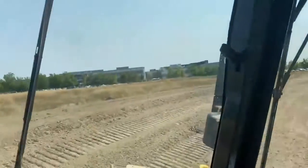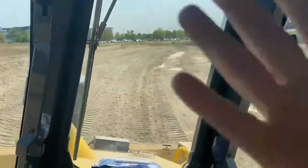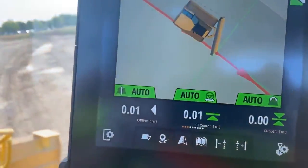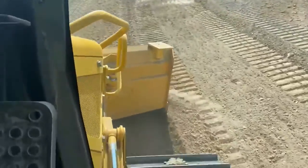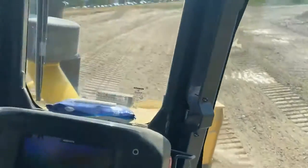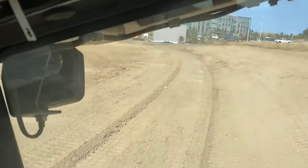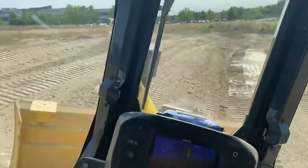I'm on the mound here, operating one hand, two hand — safely — with horizontal control and blade autos going. I'm just cruising along and the blade is following the toe on the slope. I've also been using the offset feature on the flat, so it's going really well.